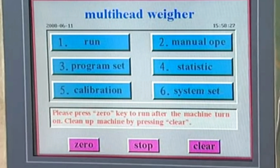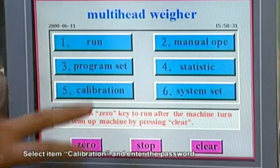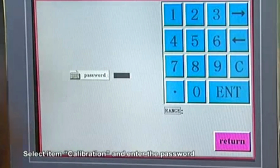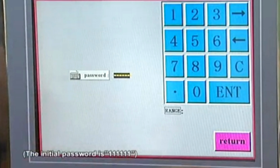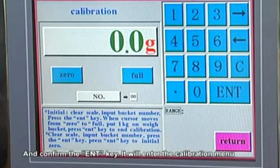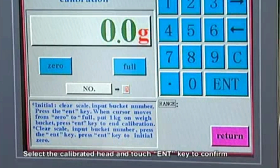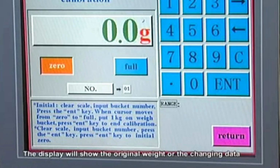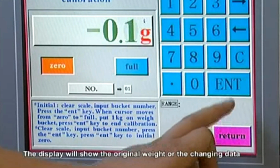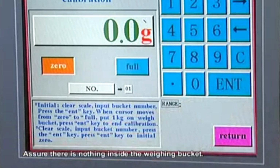When there are many fail keys, adjust the linear amplitude accordingly. The average quantity of combined buckets is the most important data to judge the machine performance. Its optimum value is between 3 and 4. If it is less than this value, touch the minus key to decrease the linear amplitude. If it is more than this value, touch the plus key to increase.